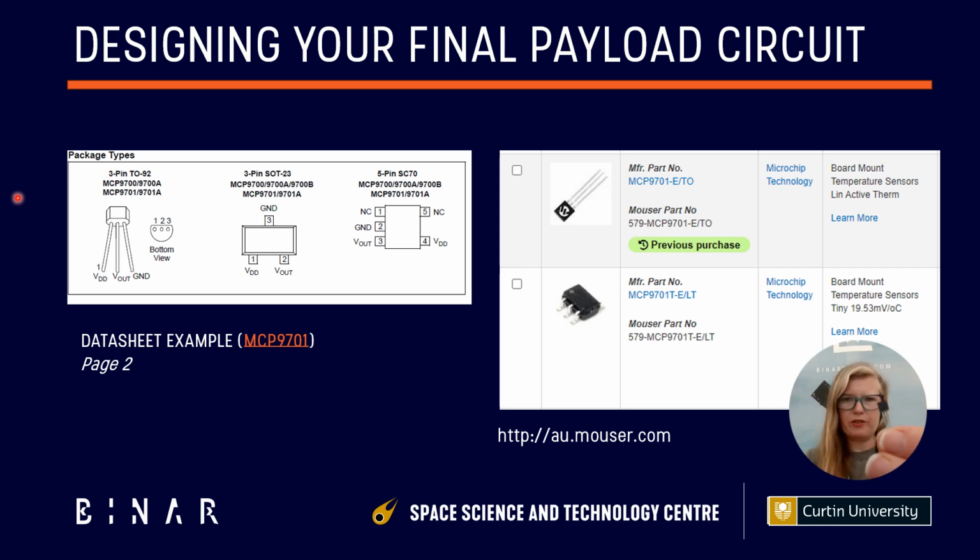We've got our little temperature sensor from our Bintro boxes and also from week 19. And I've opened up the data sheet here just because we want to remind ourselves what the pins do. So if we're looking from the bottom view with the flat side toward us, we've got the VDD or supply voltage, the V out, and the ground. So this is the temperature sensor MCP9701, but you want to have the data sheets for the components that you're using on hand, so you can remind yourself what all the pins mean. Double check the voltage requirements, current limits, etc., so you don't fry any of the components that you've already got.